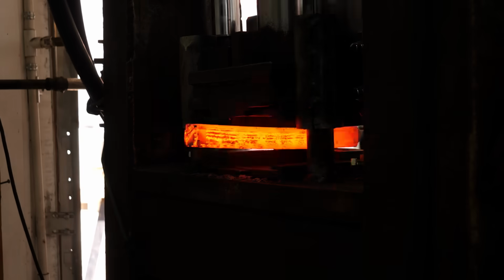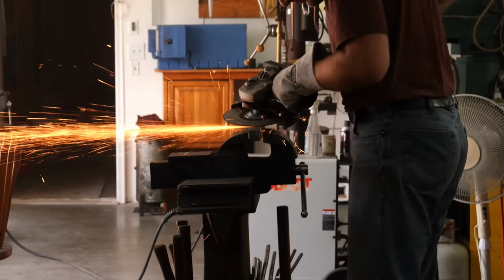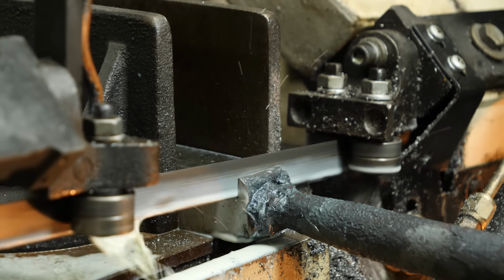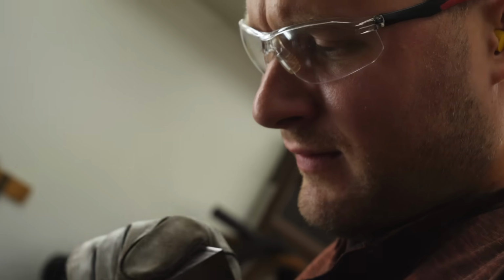For the next forge welding operation, we're going to take 4 of these pieces and do what's called a 4-way, where we put all 4 of them side by side instead of stacked on top of each other, and that'll create a mosaic picture on the end of the bar. That'll look something like a little explosion or starburst on the end of the billet.